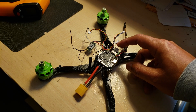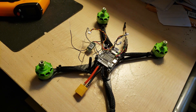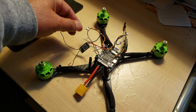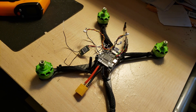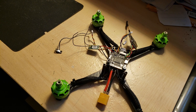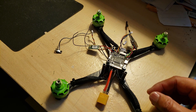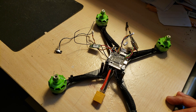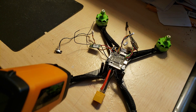The ESC is disconnected, the camera is disconnected, the beeper is disconnected, and the XM Plus is disconnected. Once everything was installed, I double-checked with an ohm meter to make sure there's no short — everything's fine. But here's the issue: I believe I have a bad chip because the temperature gets pretty hot.